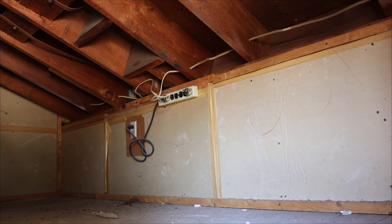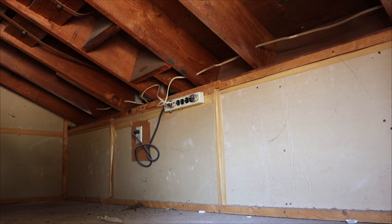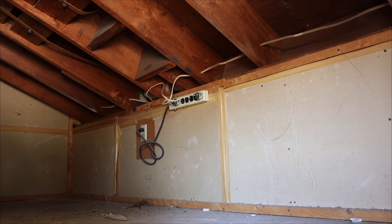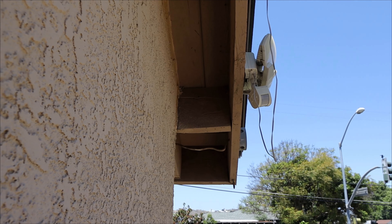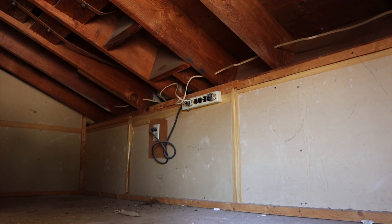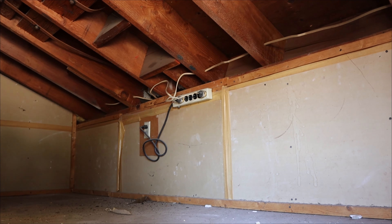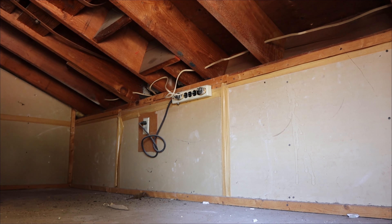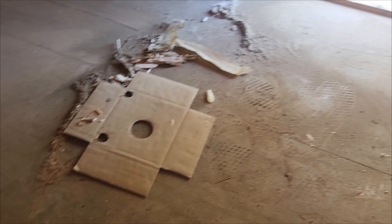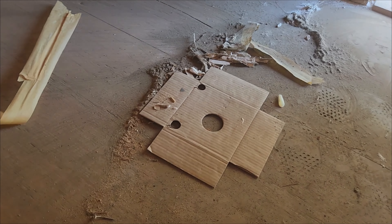So what I want to do is unplug it and then wire directly to the outlet, so we actually have outlet to outlet, so then I can put an outdoor receptacle hidden in the eave right there. Probably just one, that way we can plug in the security cam as well as things like Christmas lights or whenever we need it.